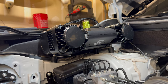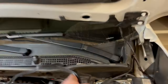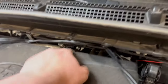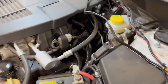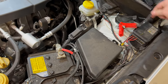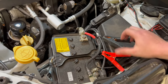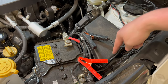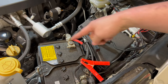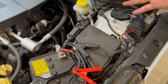The next thing we're going to do is the wiring. It comes with this nice heavy duty cable, which we're going to run across here, zip tying to these little points. If you're lazy, you can just tuck these over here and clamp them on when you want it. But what we're going to do, because we're fancy, is cut these off and hardwire them. Now this would be dangerous, but we're going to add a fuse about right here coming off the red wire - and it's going to be resettable, so it'll be super safe.